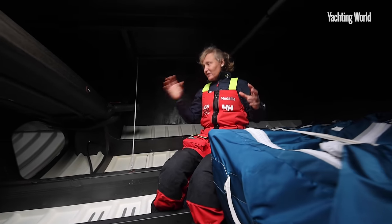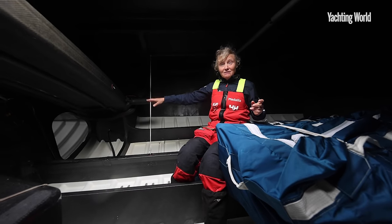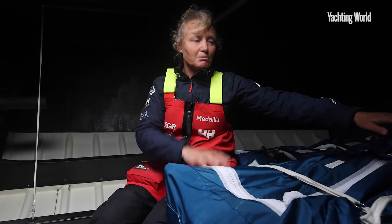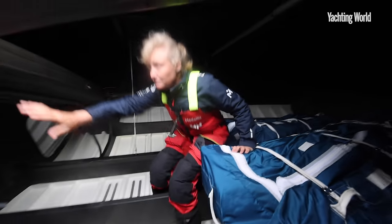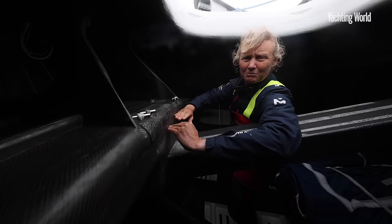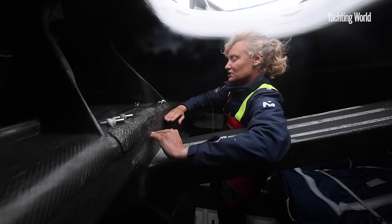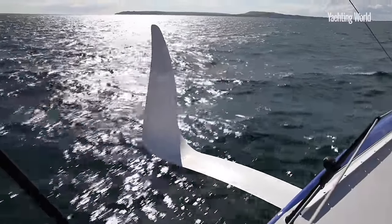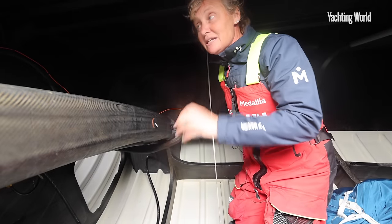We're now in the section forward of the main living accommodation. These are watertight doors here — I tend to leave them open so that I've got easy access. When I'm sailing, there's nothing up here, because we don't want weight up here. So these sails are just here for storage. And then there's some foam under there, which helps us to meet the rules for the amount of buoyancy that we need in the boats. The main thing really in here are the foil cases. So my foils retract inside these cases and meet in the middle here. When we pull them out, we've got a 4-to-1 purchase that pulls it out this way, and then a single line that pulls it back in again. And then this here is the hydraulic ram that rakes the foils, and there's a manual pump on that, and I can rake them up to 5 degrees forwards.